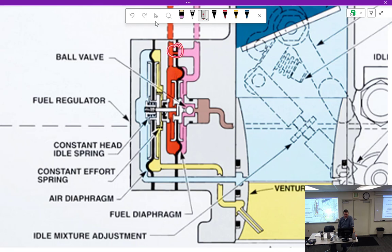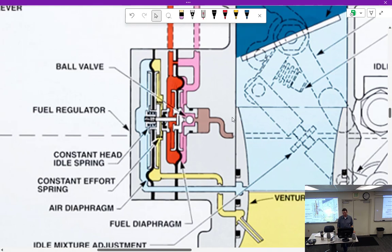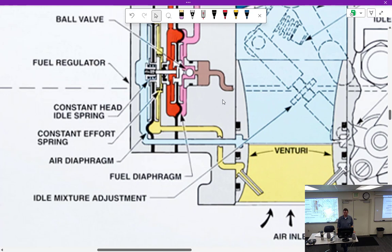I don't know why that is — I could make up some sort of explanation but I can't think of one right now. This side is bigger than that side. Alright, so when we increase air metering force, the ball comes off its seat and opens, allowing more fuel to flow. We can talk about pressures and volume, but when this opens up, more fuel comes out. And by the way, it's going to be more pressure — that's going to be very important.